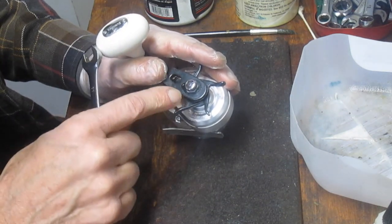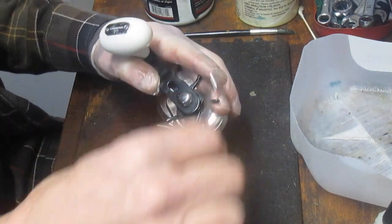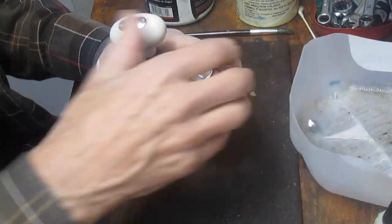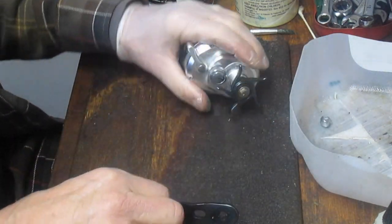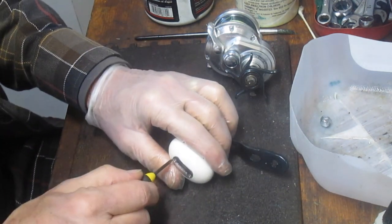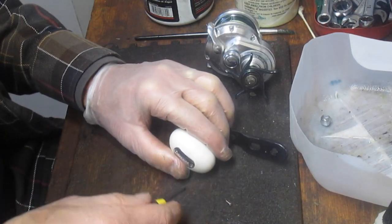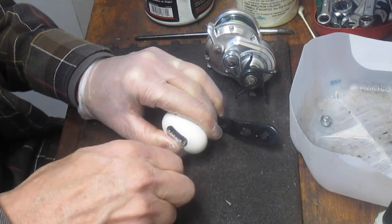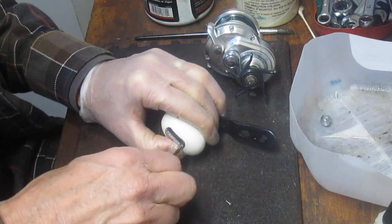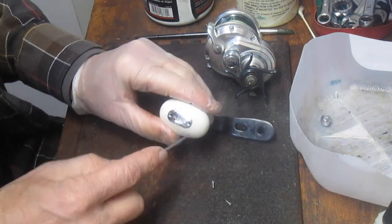The lock cap is off. I'm going to use an 11 millimeter nut driver to remove the handle. The handle is probably the first part of service, so let's go ahead and do that. This is a little bit different than most — this handle has two screws on it. It's hiding a ball bearing in there that actually does get oiled, so we're going to remove those two screws. There should be a little cap underneath and then a little ball bearing.